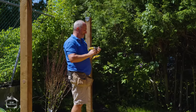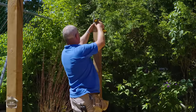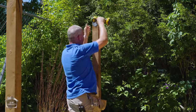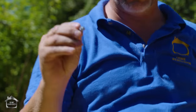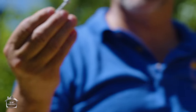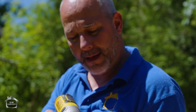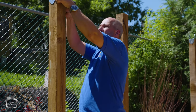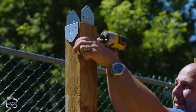There's still a misconception out there that you need structural nails. A lot of guys are still working with structural nails — that's a pain in the butt, hammering nails all day long. You can just drive a screw with a six-sided hex head. Structural screws have a stamp on them with a number related to the strength capacity of each screw. An inspector can read that number and know it's rated for hanging joists and hardware — the same capacity that a nail is. You just put a screw in every one of these holes. Piece of cake.